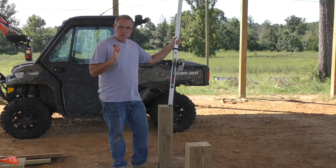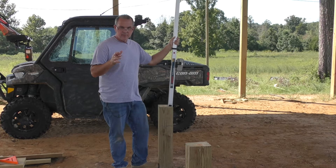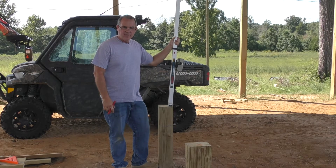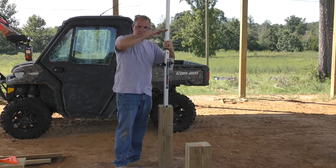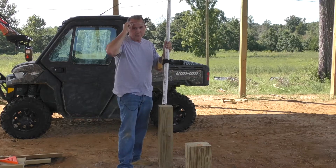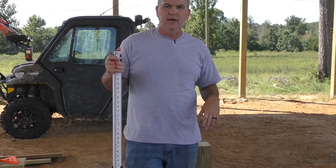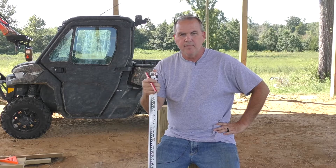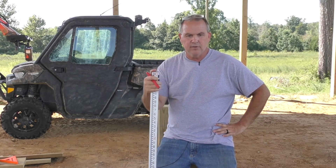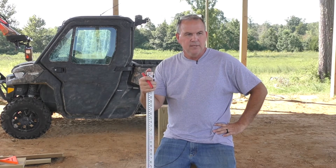I hope that wasn't too confusing. Watch it again — it's really easy to do. But if you try to figure this out like I did without a little help, I sat over here on a pile of wood for about 45 minutes going 'what?' In the end it was easy because I was trying to come in from the top — my 30 inches from the top down — when in fact I should have been coming from the bottom up. So that is how to use a rotary laser to determine post height and where to cut some notches for beams. Got any questions or comments, put them down below. Make sure you subscribe and like our videos. We're going to try to build this channel up over time and eventually have a website called Penders Creek Farms where we sell a few things. Peace out.